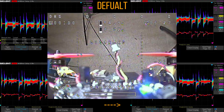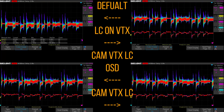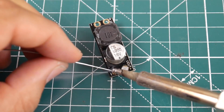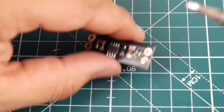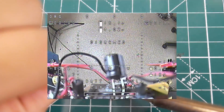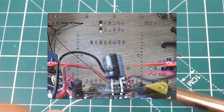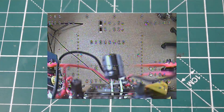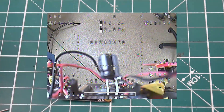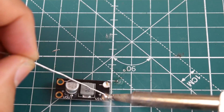If I boot it up again and my OSD is dead, I'm going to blame it on the LC filter - it's very strange, and there will be a second part where we dig into this further. After seeing that the camera still had noise after the LC filter was connected, I gave power to the camera from the LC filter as well, with both the VTX and camera still connected to the OSD. There was still noise and the OSD was still flickering. So I tried putting a low ESR capacitor on the five volt rail to clean out the noise, but it did nothing - the OSD was still flickering.